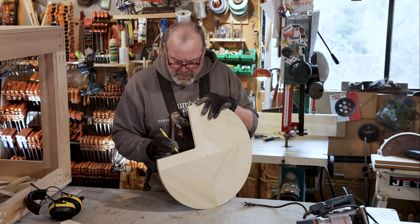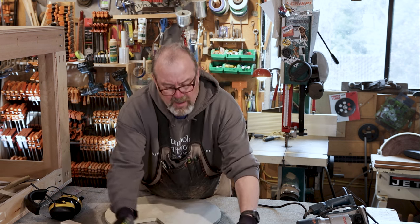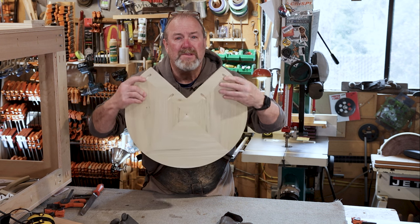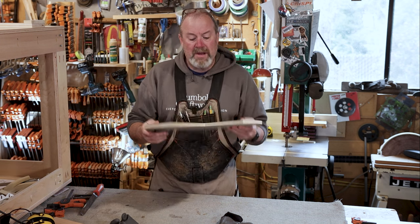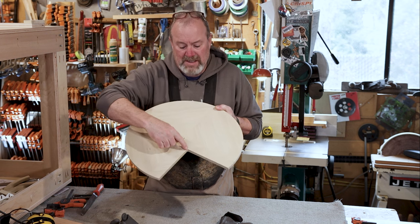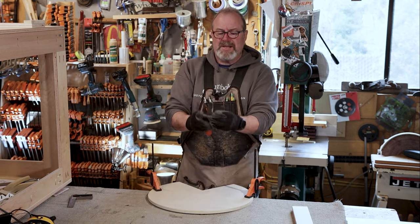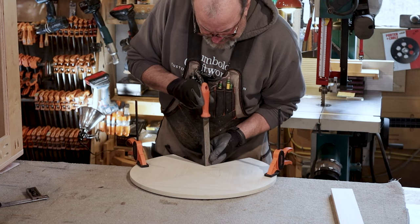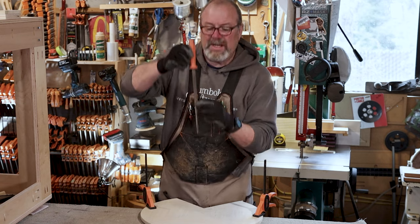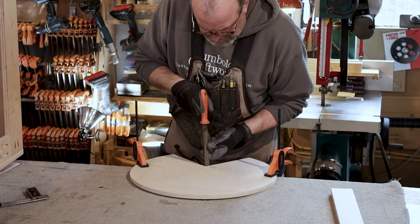So what I'm gonna do now is mark up on the inside of the little Pac-Man mouth here, so I know, all right, this is the side you wanted to use. Put some pocket screws in here, 3/4 of an inch in. They're both exactly the same. Now I just have to notch this piece out right here. We're just gonna use a wood file. It's got files on both sides here and both sides here. I'm gonna start right down the center, and I'm actually gonna use this point right here, the little corner, and we're gonna go right towards the center.